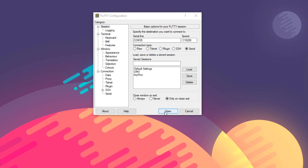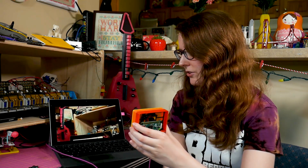You can still access the Raspbian OS with this setup. You can either use PuTTY or another way to access the serial monitor and dial in that way to open up a terminal. The other way, if you want to get the GUI up with the HDMI output, there are two text files that you edit during the full setup — you just take out those two lines, which are basically putting an overlay so that you're not getting video output. You take those out and you can still access it. So if you need to, for example, change what camera is connected, you can do it that way. Just a cool little thing you can do with your Raspberry Pi.